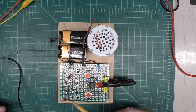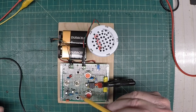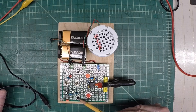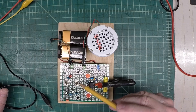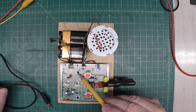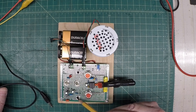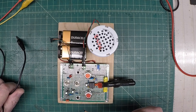You can see I added the circuit that I shared the schematic on right here. I'm just using my audio plugs here to connect the white noise generator back to my original input source, so I can still use my iPhone or a separate signal generator just by plugging in here. The way I'm coupling the white noise back to the circuit is just using a jumper to tie the two in together.